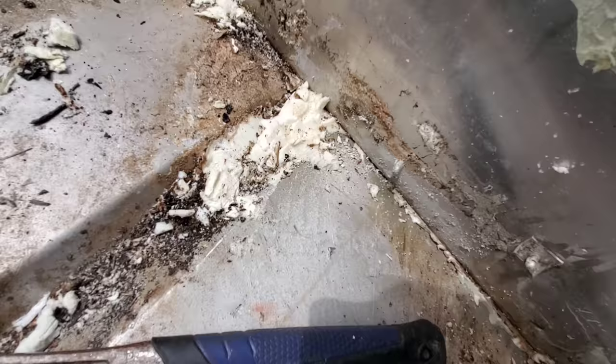And my impact, and as you can see, I'm just tapping those through, hitting that angled aluminum. All right, just getting a measurement inside the hatch, cutting off my strips of the Artec foam, stripping it. Gorilla construction adhesive, I'm gonna put a little bit on the bottom, couple little spots to tack it, and I'll just glue this in. I'm going to hold off this channel so water can drain through. And I'm going to put a strip here, and a strip back over here. And that'll space it off the bottom for the next layer of foam, so it'll have air underneath to ventilate and breathe.